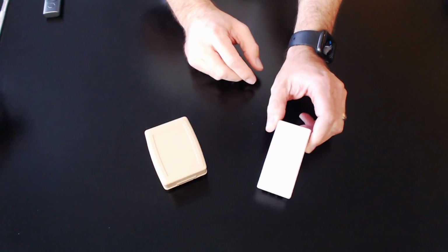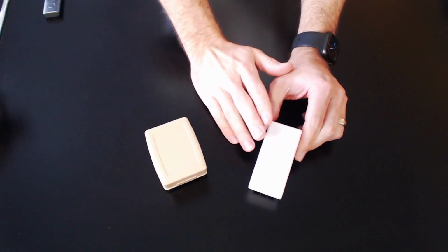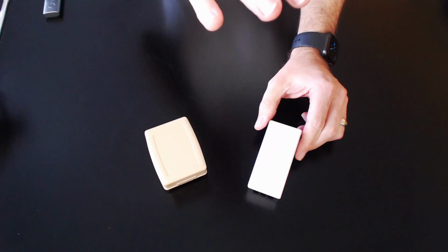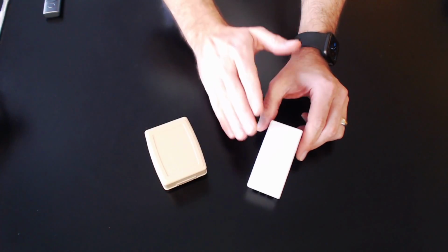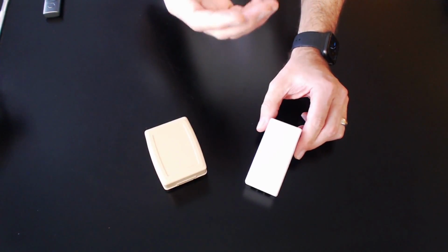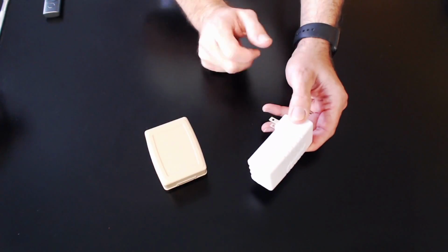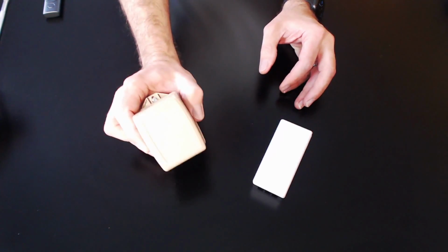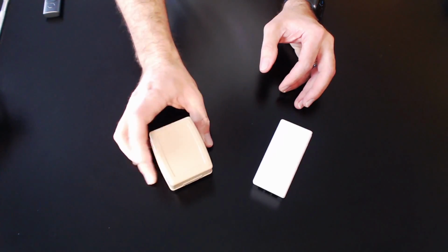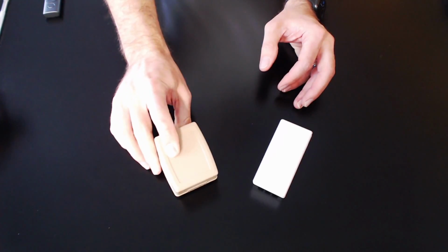But when this starts to burn in, you're going to see it sag down to about 13, maybe 13 and a half volts, somewhere in there. But it's not going to drop below your 12 volt range. So if you're powering 12 volt hardware, you shouldn't run into an issue with this type of power supply where you're underpowering your hardware. Where you will run into issues is with a lower cost transformer. This one's rated at just under 13 volts, and eventually that's going to sag and burn in, where you're running it at less voltage than your hardware needs.